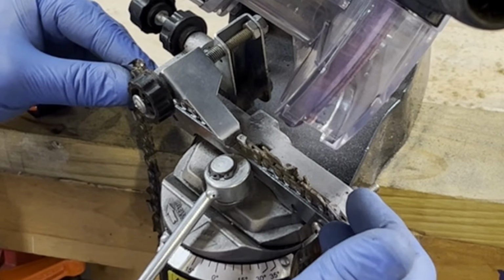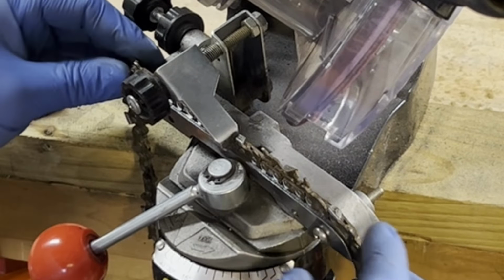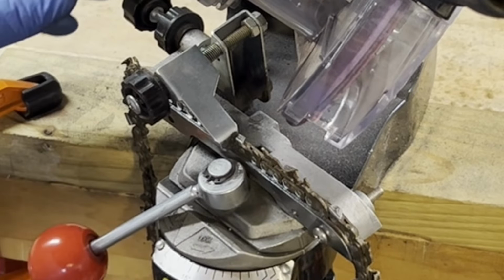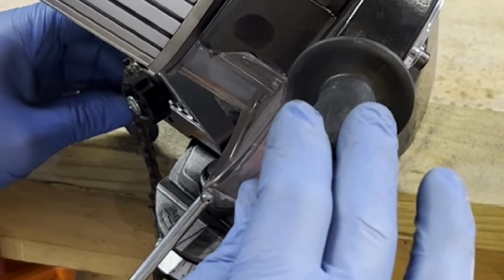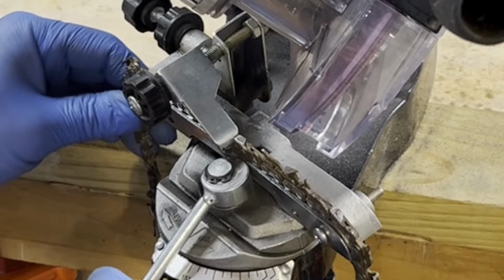And then when you switch the other direction, I think you tilt this forward. What I want to show here is just my technique that I think works pretty well. It has to do with the cleanup pass. So when you first cut it, you adjust it so it takes a light cut, but you want to make sure you clean up, put a new edge on the straight and the corner. So just get it like this, cutting a little bit,